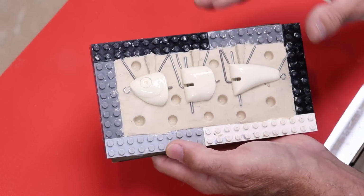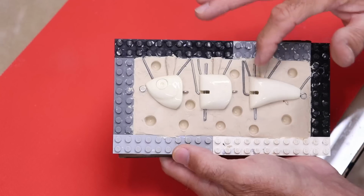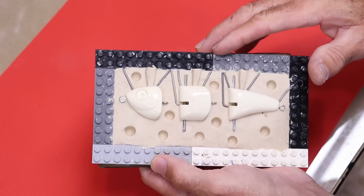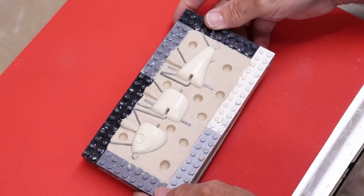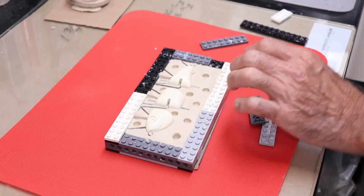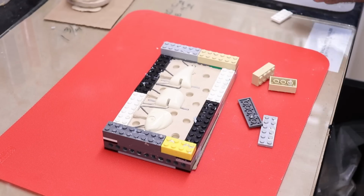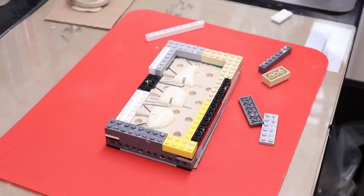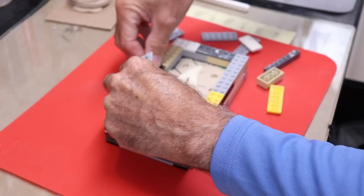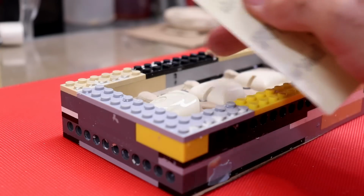If you haven't made a bunch of molds, I would pause the video right here and take a close look at how I arranged these vents. All those little vertical pieces that are going up, I used solder to make those. And I think if you stare at it long enough, you'll realize why I put all those in. So now it's time to build up the box. So what I'm looking for is about 1/4 inch of wall thickness for the top of the mold.